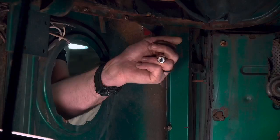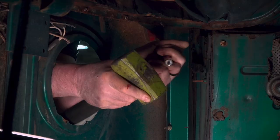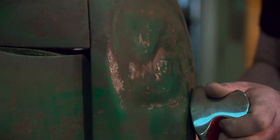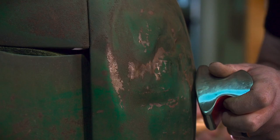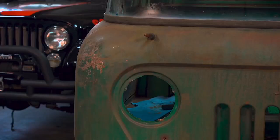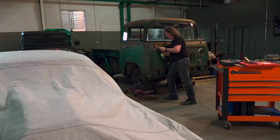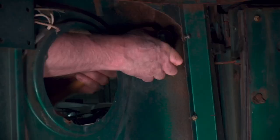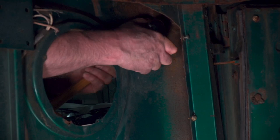That's the challenge to bumping metal — sometimes you've got to get creative. Once the panel starts to move back into its original shape around the edges and in the middle, we can start focusing on working out the ridges and valleys in the center. This requires hammering on and off dolly to work it back into shape. Don't trust your eyes alone to gauge the work — with all the different colors and shapes, your eyes can deceive you. Trust your hands to tell you where the high and low spots are. Once you have the overall shape where it needs to be, you could stop and be within spec for body filler, but the idea is to use the smallest amount of filler possible. The hits are now very light and quick, designed for small movement and planishing of the metal. What you're after is a surface that requires just a thin skim coat of filler, if any.